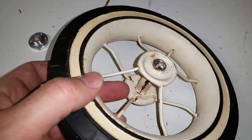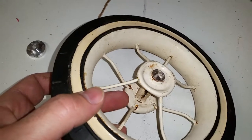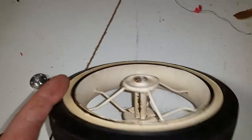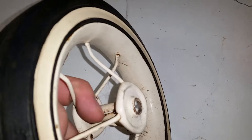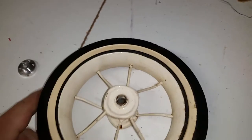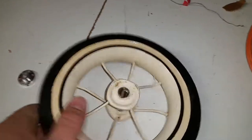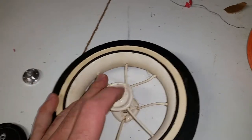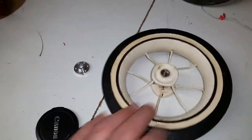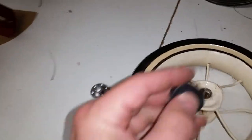Looking at the backside it's just folded-over metal, so I'm not sure how well it'll drill out or how easy it'll be to put screws through there. The center of the axle tube in the back is all cracked open — it's not welded, only the ends are welded. If I grind those down it won't be welded at all. These are metal wheels and pretty heavy by themselves, so I'm hoping my motors have enough torque to push the whole tricycle.